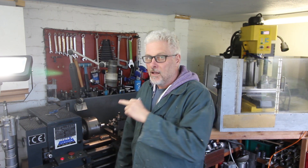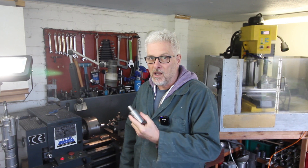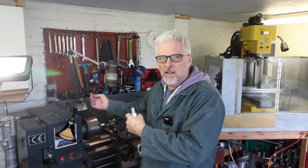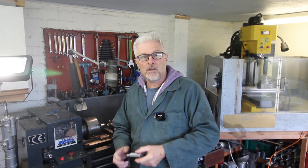Having said that, you could hear the lathe was bogging down — that was pretty much as much as I'd want to push this particular machine. The motor is a continuously rated 1,000 watt motor, but even so, that's about as much as you really want to take off in one pass. Thanks for watching, see you next time.